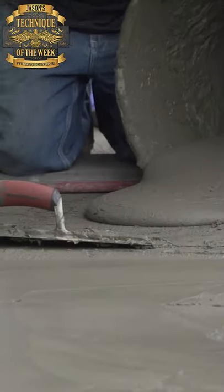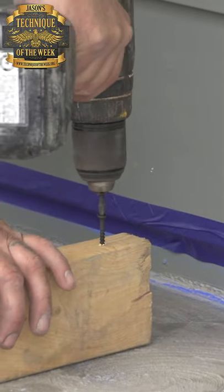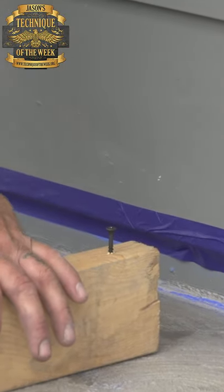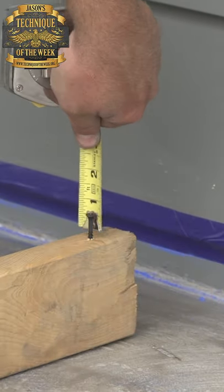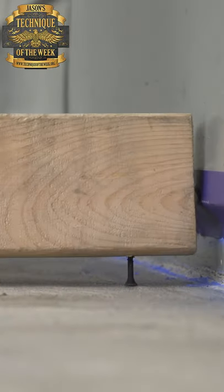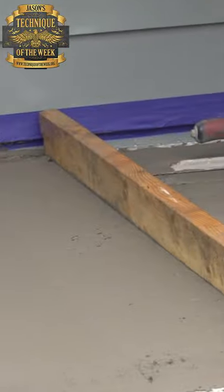What we're going to do is try to bring this up three quarters of an inch. We're going to find a straight two by four. All I'm going to do then is take a screw. I know I want three quarters back here, so I'm just going to fasten the screw into the bottom of this. What this allows me to do is when I ride this along here and we pull the material, it's going to keep it all at a consistent height this way and slope it down to nothing over here.